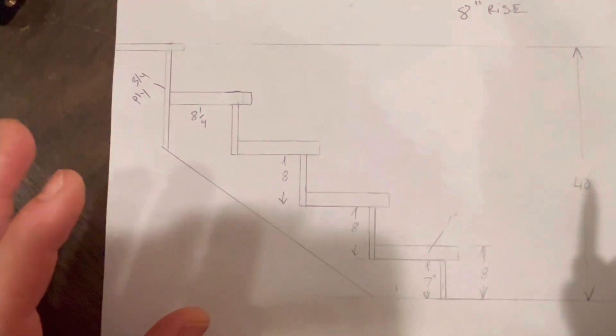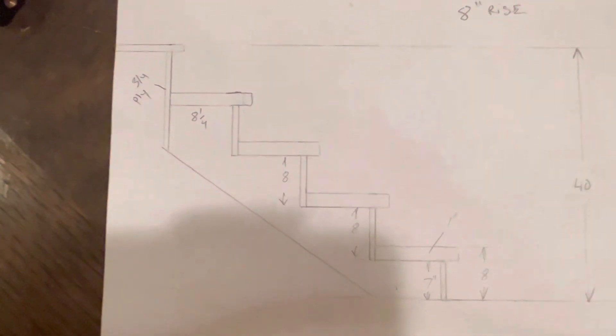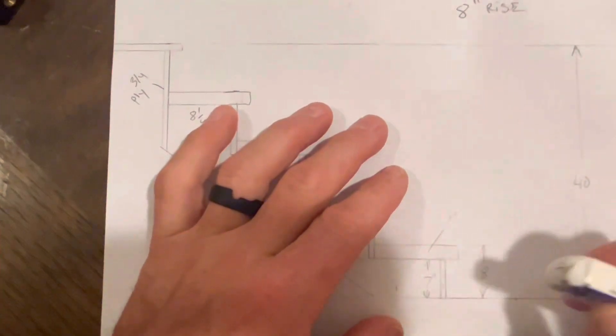So it's important that when you're not planning on putting a riser on your 3/4 hanging material, you make this deduction and cut your top tread at 8 and a quarter, so that once you put a riser on it becomes 9 inches, just like all the rest. With a carpeted stringer you don't have to make any deductions — you just measure subfloor to subfloor, divide by the number of rises, and everything is good.